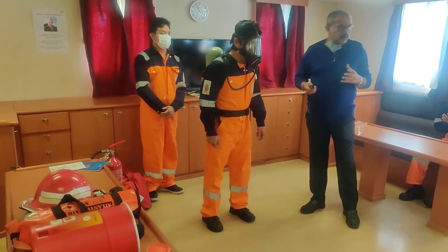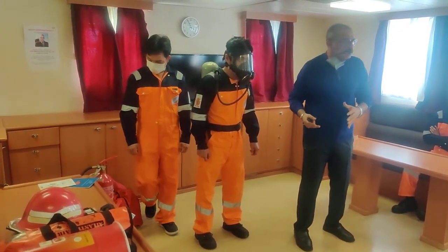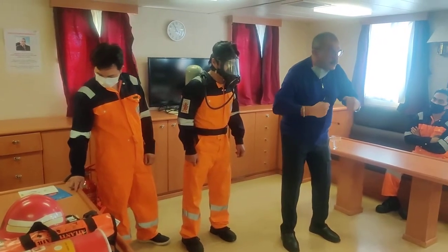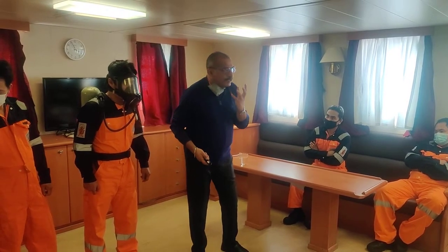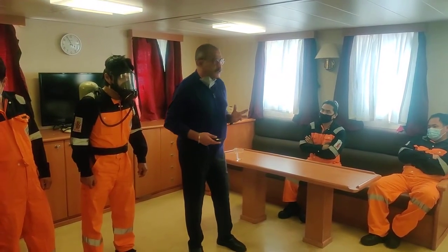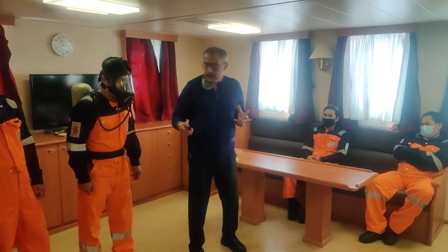This test also is to be done. So first is the whistle test, of course, we check the bottle, how to don it. We do the shoulder strap first, then we do the waist strap, then we do the whistle test, and then we don the mask, we do the air tightness test. Okay? Is that clear, gentlemen? Okay, thanks. Take it off.